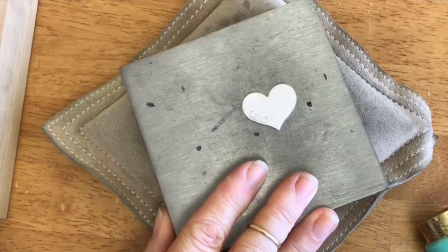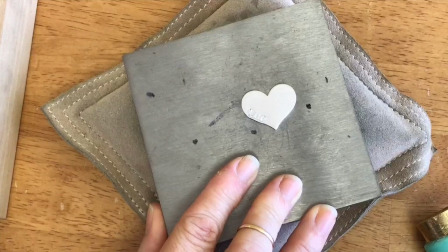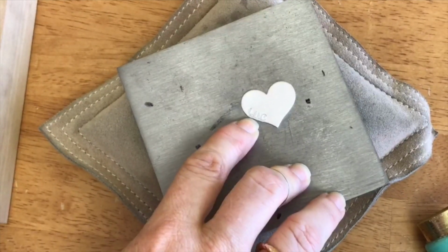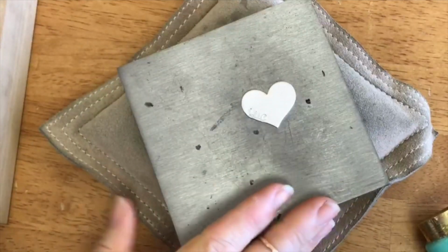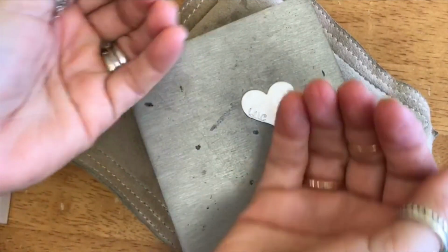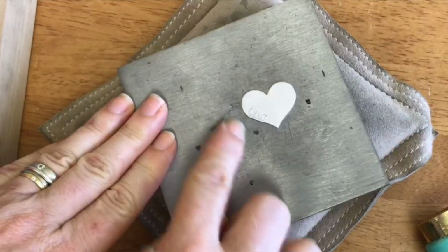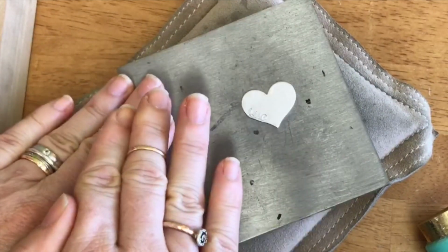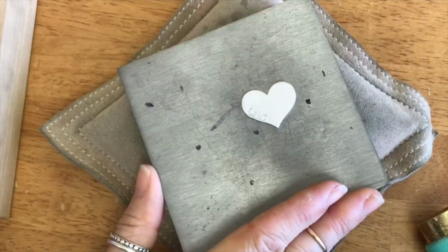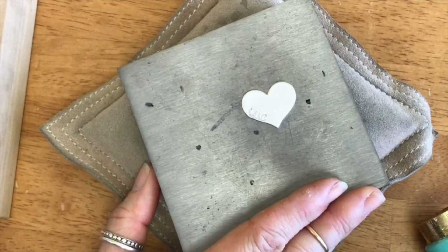And then I think you don't want to go too hard because then you could end up kind of pushing the metal out too far, huh? Exactly. So you don't want to be too close to the edge because then you'll get a little distortion this way. Remember that you're moving the metal, not removing it. So if you're right on the edge, it's moving the metal out this way, and that's when you get the bumps like this, or you get a cuff, a long straight piece that's kind of curved. This is a 1 pound hammer that I'm using.